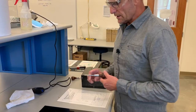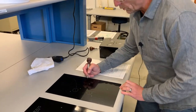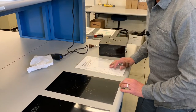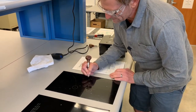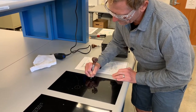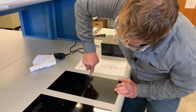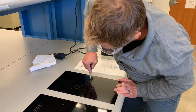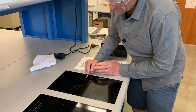Now that we've done the engraving, the next step is to use a center punch to make a tiny dimple for punching out the holes at each of the locations. We're going to use our center punch on each of the crosshairs. I'll point the center of the punch right in the middle, then put down firm pressure with a twisting motion sufficient to make a nice little dimple in the middle of the crosshair.